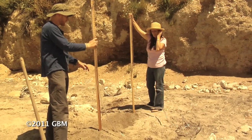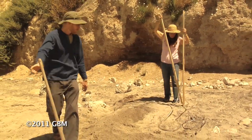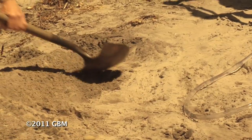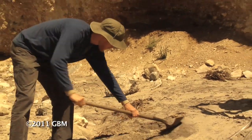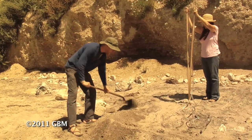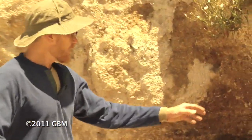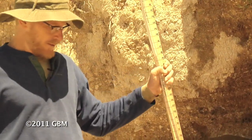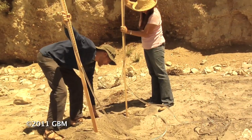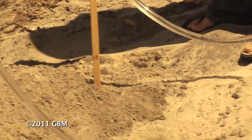So I want to make sure that that is the spillway. So I can take off this part of the berm, and we take that dirt we're digging out to put on top of the berm - raising it while lowering that. Then we pack this down. This water is going to back up and overflow this way - we want it right where the water would be overflowing. The water will not overflow over the berms. We measure there where the water will flow.